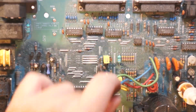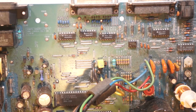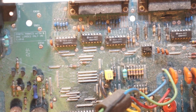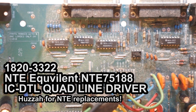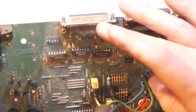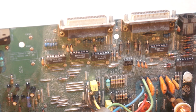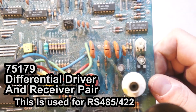So here's the back where we have the 2 serial ports. They're all Hewlett-Packard branded ICs. RQAD 9042, Hewlett-Packard part numbers. 3222, 3222. I bet these are serial transceivers of some sort. So here's your main serial interface, and this is the one for the secondary. We have a TQ4 something, I don't know. It's all Hewlett-Packard proprietary as usual.